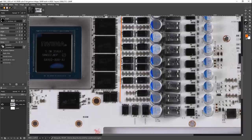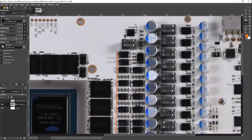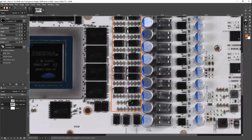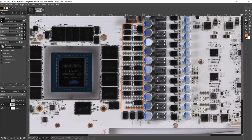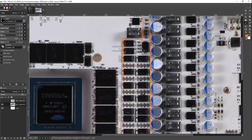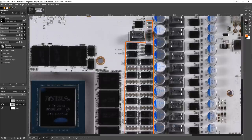I'm not sure that I'm actually highlighting it properly, because it's really hard to tell what part belongs to what. I'm guessing that these caps over here are probably from memory, and then this is all core power. The thing is, it's really hard to know what part exactly belongs to what rail. This should be memory power down here. The reason I'm highlighting this is just that this output filter is insane. We've got a mishmash of SP caps and multi-layer ceramics.